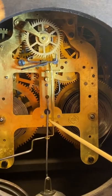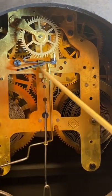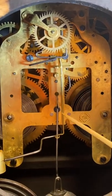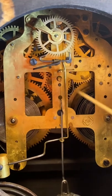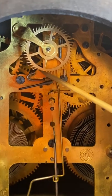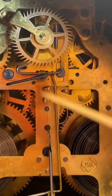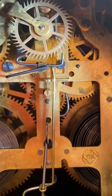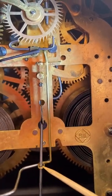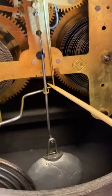Here's how it actually works — I'll be brief since I know a lot of people don't care about all the details, but you need to understand a little bit to put it in beat. This is where the clock has stopped. When you give it a little push, a tooth comes down and hits this inclined plane on this pallet, pushing it in one direction. Your pendulum is suspended on the end of that — it goes through a hoop in this verge wire — and it gets a little impulse in that direction.